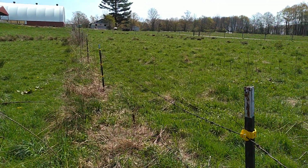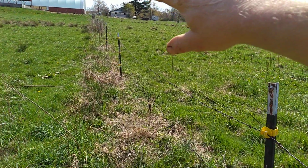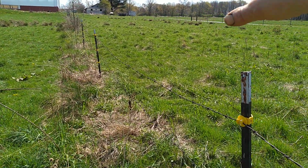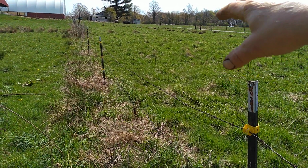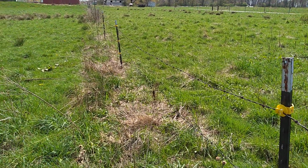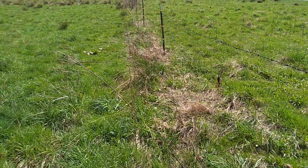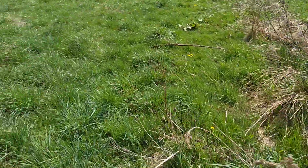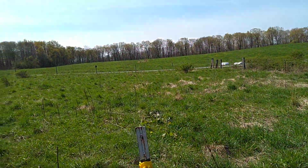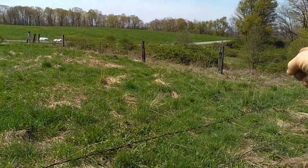That's a 96-foot spreader pipe, and they had 120 foot. This is a filter area where the wastewater from the milk house drains down and it's supposed to perk its way down through here, and the grasses will absorb the phosphates and other nutrients that are still in that water and basically filter it. Well, the plan called, I forget how far down this was supposed to go, but basically this fence was supposed to come down and then cut across here. It was like 50, 75 foot from that fence line.